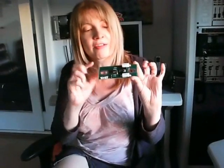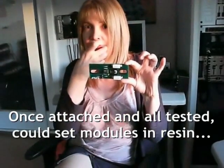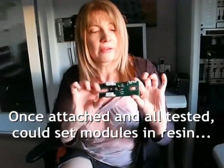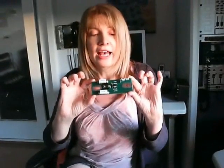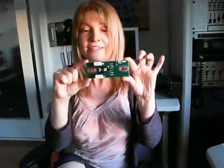This battery management has firmware that allows us to set the high and low tolerance for charging. You can see it has an input and output, because these things sit in a daisy-chain setup with the master controller. This goes through the firmware which we can program — there's a little PC input in there that we can connect up to. And when charging is done it trips, and that's what these shunt resistors are for. It says that the battery is done. I'm going to put a little trip LED on there so that we know when it's tripped.